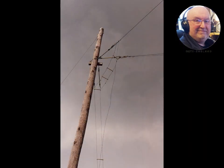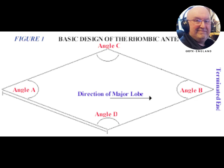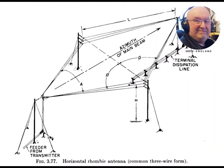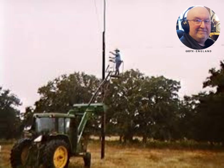A horizontal three-wire rhombic antenna example is terminated with a resonant stub transmission line power reflector instead of a resistor to increase efficiency. The rhombic antenna can radiate at elevation angles close to the horizon or at higher angles, depending on its height above ground relative to the operating frequency. Its beam width can be narrow or broad, depending primarily on its length. The shallow radiation angle makes it useful for skywave propagation — the longest distance mode for shortwave — in which radio waves directed toward the horizon reflect from layers in the ionosphere and return to Earth far beyond the horizon.